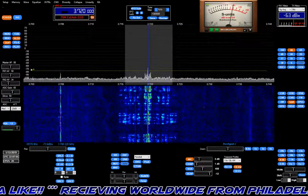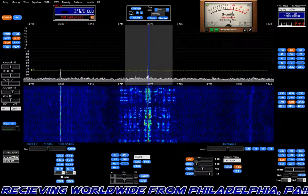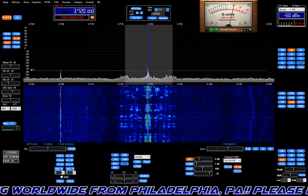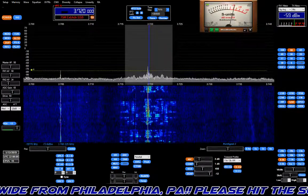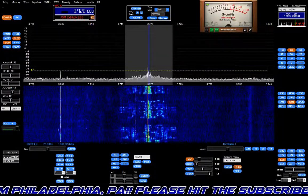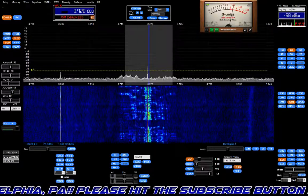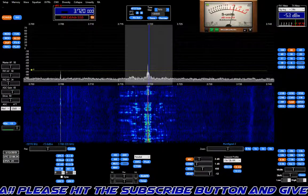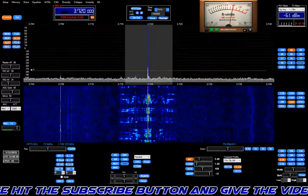Yeah, so we're using a little bit of a different mic tonight. I think my son is listening with WebSDR. This is a Behringer condenser mic, a B1, which works very, very well. It's only $99, and these things sound great. I think it's the best-sounding mic for the buck. If you're going into a rack, of course you need the phantom power for it, 48 volts and stuff like that. It won't go directly into a radio. But it's a nice mic. I've always liked the B1s.